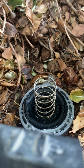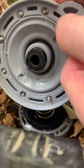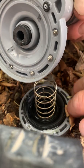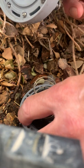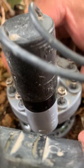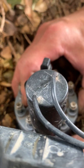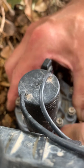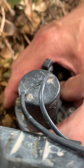Okay, so first thing is to put the o-ring on the nipple, and that's really key because I've put this together so many times and it leaks like crazy from around the base of the solenoid. Now we've got the diaphragm centered in the valve seat — the valve body. I'm going to gently lower this down and try not to disturb any of the relationships, and just sort of gently ease that down and feel that everything is nice and snug and hope that the little o-ring has stayed in place.